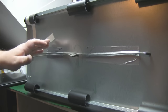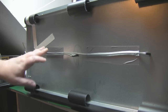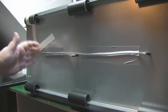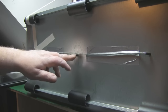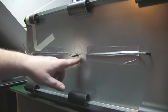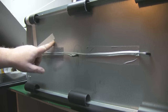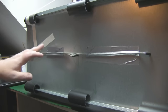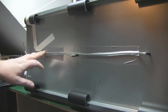At the moment it's grounded to the coax because with semi-rigid coax I'm getting a direct ground to the coax ground. I'm not sure whether having it like that is going to play a major role in the outcome of the antenna I'm testing, so I guess the only way to really know is to try it. I've got it temporary with some duct tape, but once I've got it all together and tested, I can isolate the coax by using heat shrink tubing — just remove it, feed it back through again with heat shrink, isolate it from the metal case and try a second test to compare.